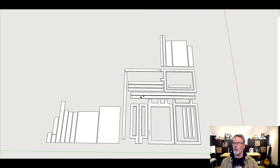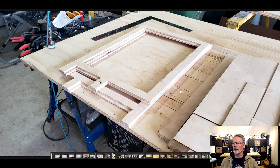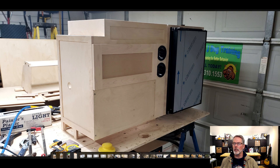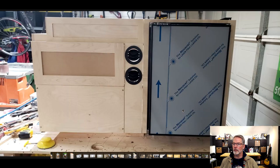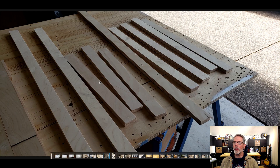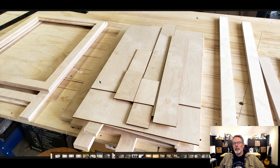What you get back from the CNC shop looks like this — these are the cut sheets for that design. It comes back as a pile of parts that need some sanding and assembly. This is what the frame looks like once it's squared up and pocket-holed together. It makes a pretty good frame, which gets filled in with drawers and other panels. The way I assembled this was to measure and reassemble everything, square it up with clamps, and then carefully pocket hole everything together — and that is a bit of work.